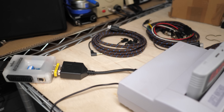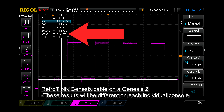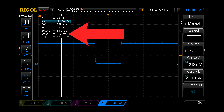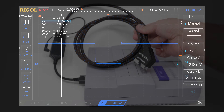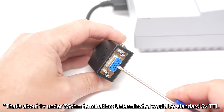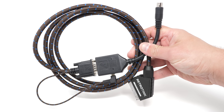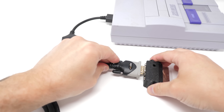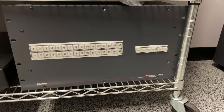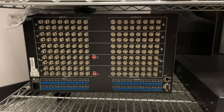I put the RetroTINK cables on an oscilloscope to get exact voltage measurements. The RGB video voltages were well within safe ranges on all adapters — the voltage was never high enough to start losing detail, and never low enough to notice any brightness drop at all. Using the RetroTINK SCART cable showed about 400mV on the sync line, which is perfect for SCART devices. The adapter itself outputs about a volt on the sync line, and since the VGA and BNC cables don't have any components inside, it'll be the same voltage through those. One volt is right on the line of what SCART equipment could handle, so if you're using these adapters with SCART equipment, use Mike's SCART cable. Sync is converted from composite video on all adapters and filtered to output clean C-SYNC, so they should be compatible with all X-Tron cross-point switches, as those require a clean sync signal.